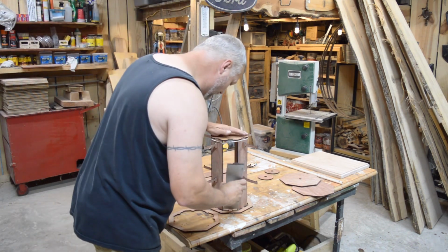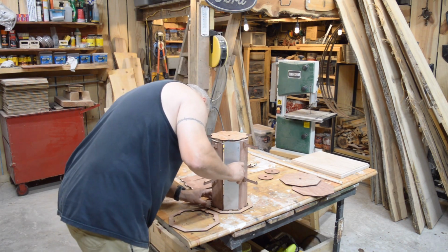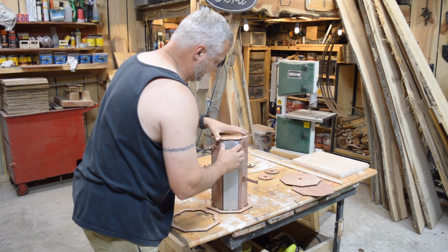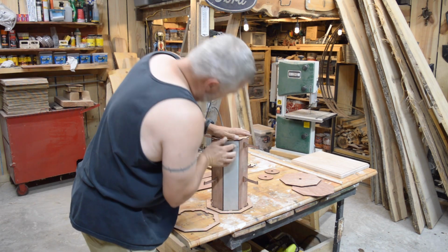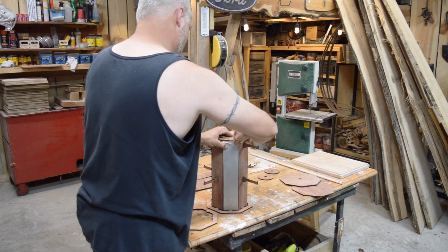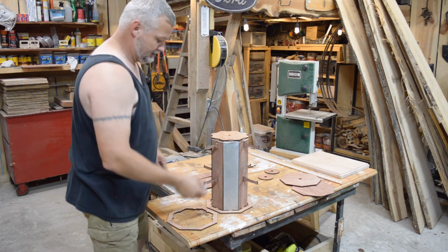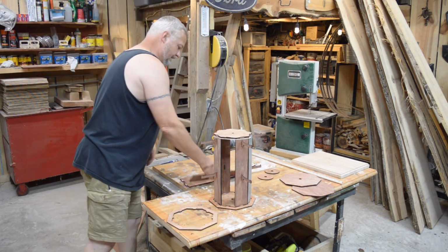These are going to go in between the keychain ones. And like I said, this thing's going to get a little tight, because the tolerances are pretty tight on this burn. And this is the 4.8, that thicker wood that I wound up getting that I'm not crazy about. I had to add a few extra passes to get it to cut it, because this was originally a 4.5 millimeter design. And luckily I didn't have to change any of the measurements. Everything still works, but this stuff is like 4.8, 4.7, 4.8 millimeters.